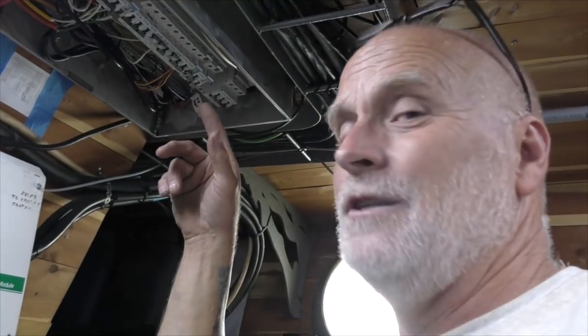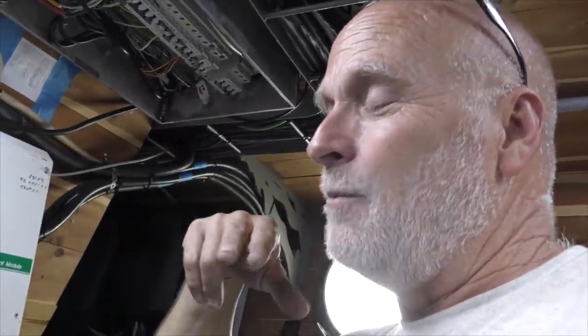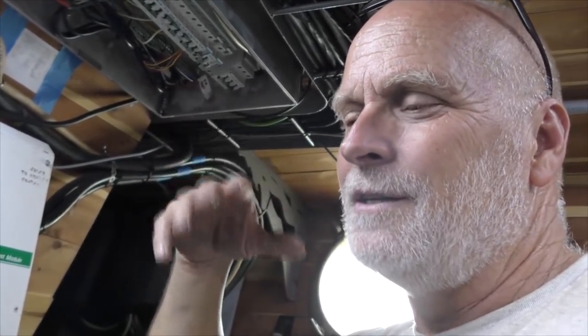Awesome. Hear that? That's the sound of AIS and 12 volts surging through the system. There's more things to change here, but that'll be another day. One of the problems is I got my blowers to cool this room running off that DC-to-DC converter, and that's maybe what killed the other ones, because we ran them for a little while and that pulls a lot of load. So yeah, that may have gotten them. This is 100 amp, it'll do fine, but I need to wire those in to the battery that starts the engine, because that's when you're going to be using them to cool this room since the main engine's on. So it makes sense to let the alternator do the job.